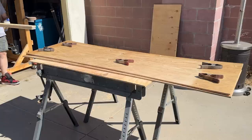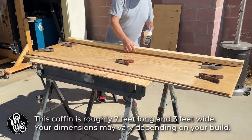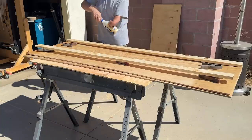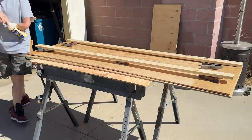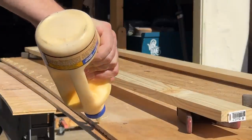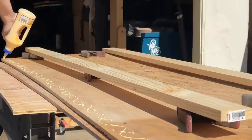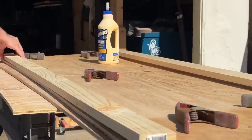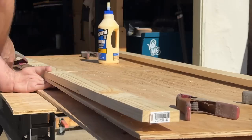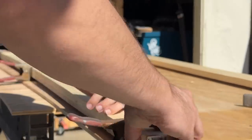After cutting my materials down to their final size, I could get right into assembling the box that would become the base of the coffin, starting with creating the sides of the coffin frame. I'll be building this with half-inch plywood and 1x3s just to ensure that it can withstand whatever the production may do with it. And that all starts with a bit of wood glue. Each piece of the frame will get glued and clamped in place, then I can flip over the panel and secure it with some 1-inch screws.